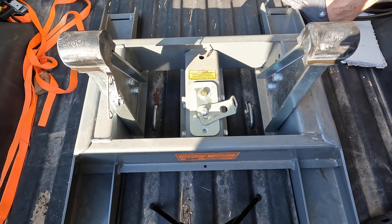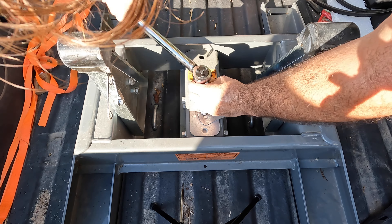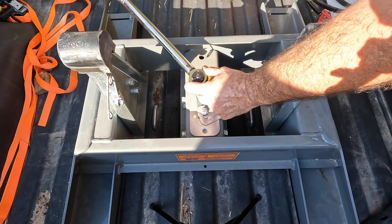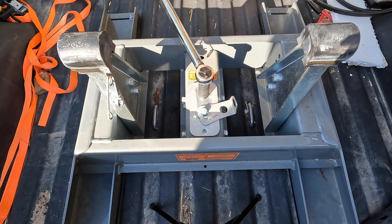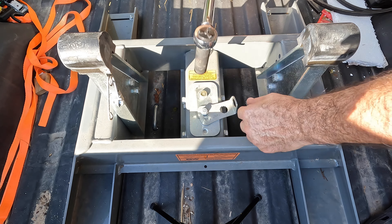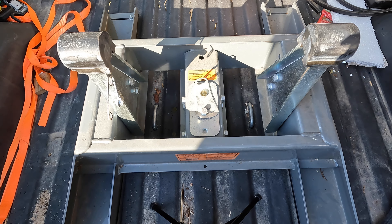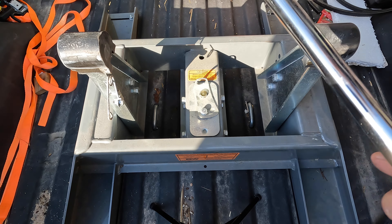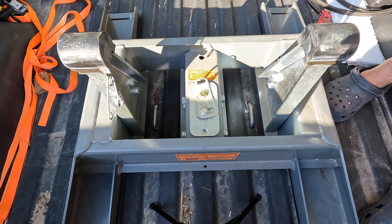65 fits perfect — that's locked. Always set your torque wrench back to zero before you throw it back in the toolbox. You don't want to leave it stored under tension. Always lock your toolbox so you actually have a torque wrench next time you go to get it.